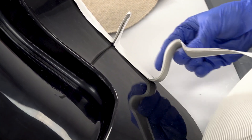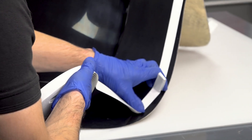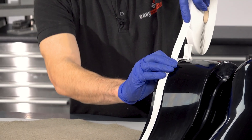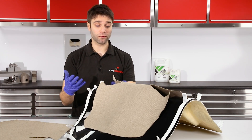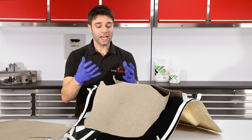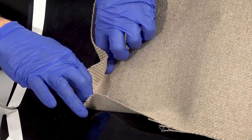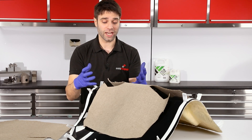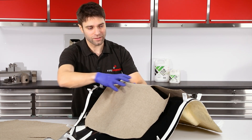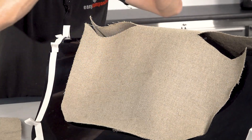These pleats are formed to provide the excess of bag required to follow the contours without having to stretch. When it comes to laying up with flax it's much the same as any other reinforcement. The one major difference is that it doesn't drape around compound shapes quite as well as glass or carbon, because the fibres are quite rough and don't slide over one another. They tend to spring back out, so for very complicated shapes you'll often need to use more cuts and sections. For this shape I'm going to let the vacuum bag do the work, loosely placing the reinforcement in position and letting the vacuum draw it down into the compound shapes.